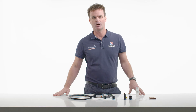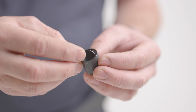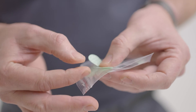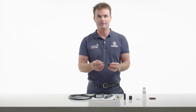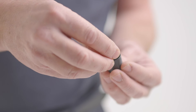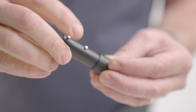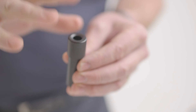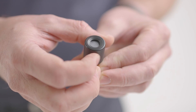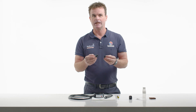To reassemble, we replace the o-ring first. A pack of 10 membranes and o-rings comes as part of the kit. The o-ring goes in the bottom of the cap — it's handy having something to move the o-ring into place. Next, take a membrane from the pack. Remember to remove the paper separator too. Place the membrane roughly into position towards the bottom. Then screw the template about two-thirds of the way down. Invert the cap and tap the membrane down onto the template — the membrane should be rotating on top of the template, self-centering the membrane. Continue to screw the template until it feels home. Be careful not to over-tighten as the membrane may wrinkle and not seal correctly.